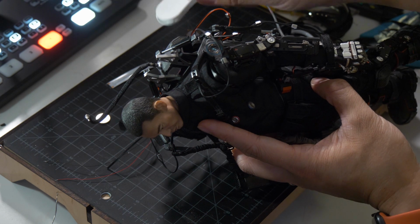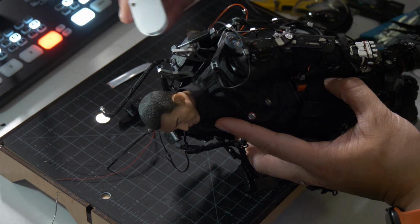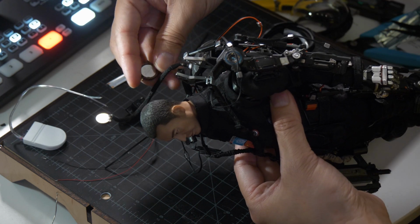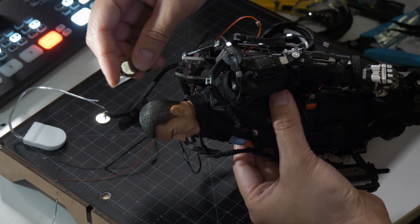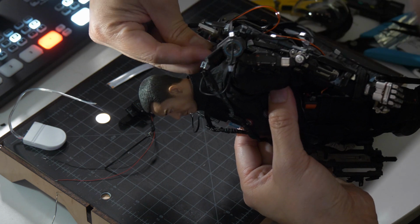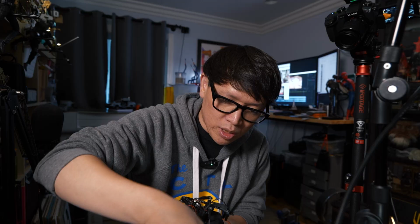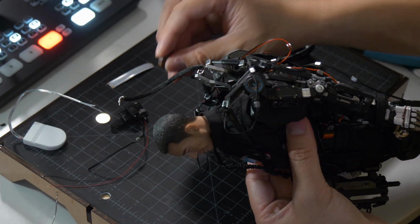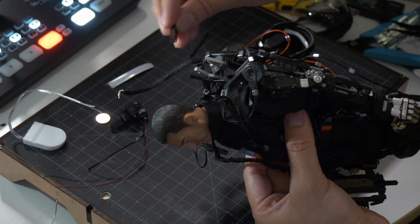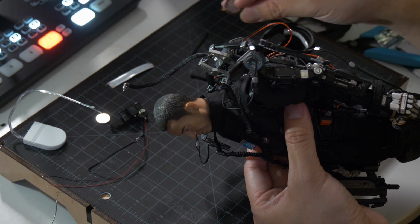And that's where I think I'm going to see if I can put one of these coin battery holders on the inside. This one might be too big. This is that 2032. Here's my other, this is that 1220 battery holder. No switch, but I think I can get that inside and drop it inside without any problem. So I'm going to solder some wires to this. I have some exposed leads, and maybe tuck that in there and then wire it and then reassemble it. And then we should be ready to do a final look and test.